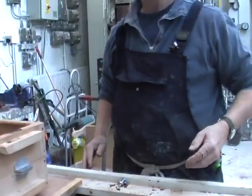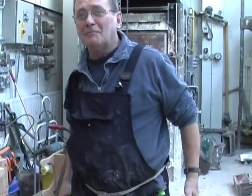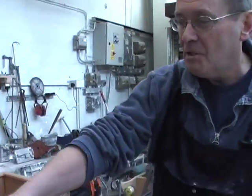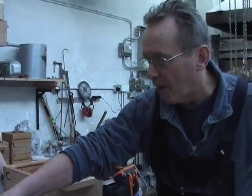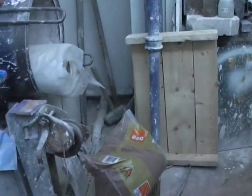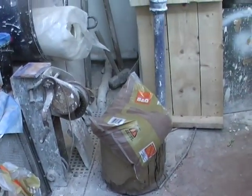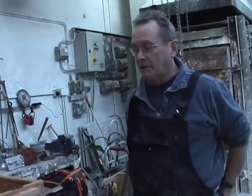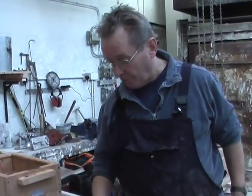So you actually went up there to get it? Yeah. I have actually used some building sand myself and mixed it up with bentonite, which is a very fine clay that is used quite a lot in ceramics. So you can actually manufacture your own, and in fact it worked very well.